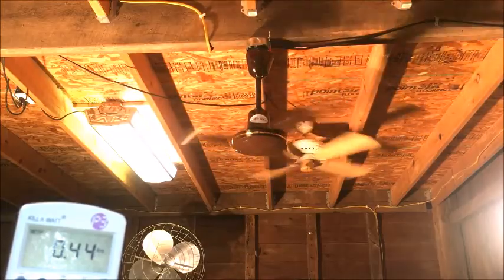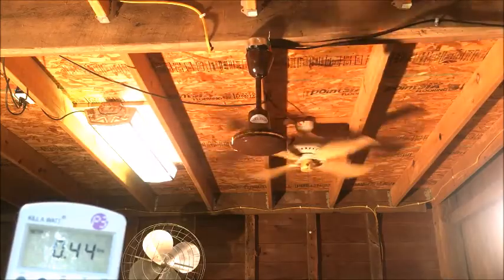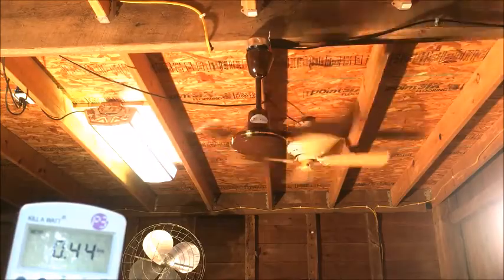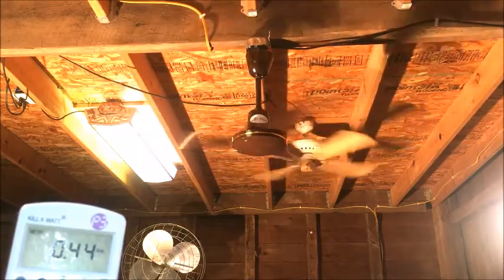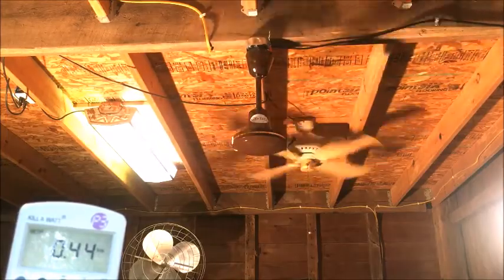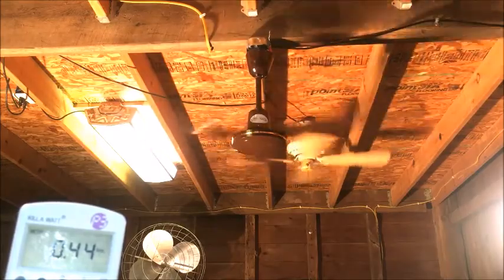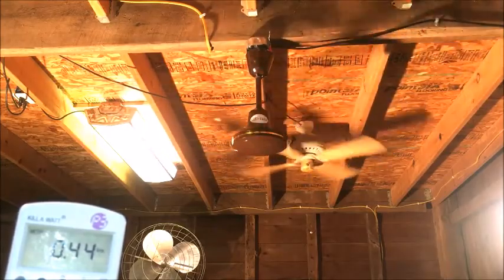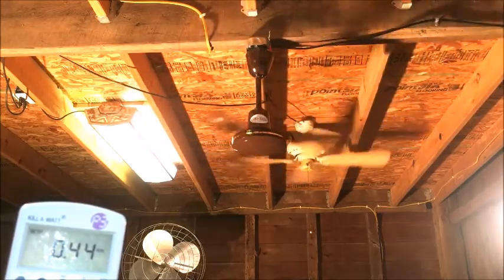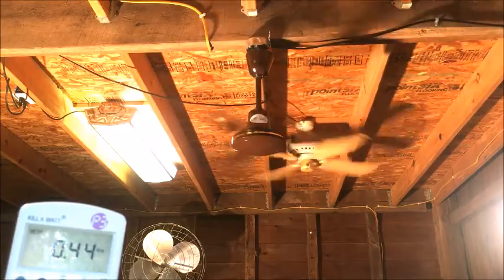So 3-speed? Yeah, like a 5 and an 8 control. I'm trying to figure out the one in my room. I think I gave you that one. That's from my original controls that were in my condo house. That was an original one, and that's a 5, 8, I measured. 5, 8, 13? No, it's a 3-speed. So 3, 5, 8? Nope, just 5 and 8. And then high is just straight high. Gotta remember, high is just like hitting this switch here. When you have a 3-speed, you only have 2 different value settings and then the high switch.